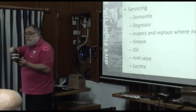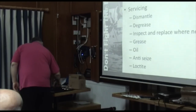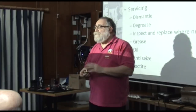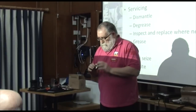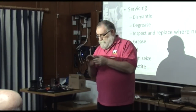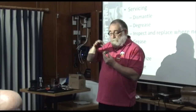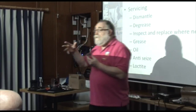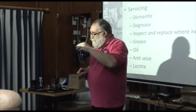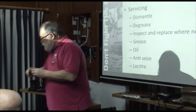if there's a housing inside, you take that out. It's usually a ring of screws. Take that off, and you're into the workings. This is typical workings of a winch. It makes that noise. Yeah? That's a ratchet gear. And these little things here that flip backwards and forwards are called pawls. Now, on some people's winches, if I take the ratchet gear off, the pawl gear, which is the thing underneath it, that is when these magic springs manifest themselves. It doesn't on ours, okay? They're captive. Again, doesn't matter about that, it's just a point. But I take the whole winch apart.